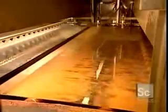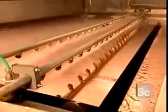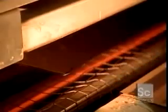The factory will seal this silver backing with 2 coats of paint. Paint by itself, however, isn't enough to protect the silver in the long term. So they first spray on a layer of copper. Sprayers rinse off the excess copper. Then the panel passes through a dryer at almost 160 degrees Fahrenheit. This evaporates the moisture on the surface in just 75 seconds.